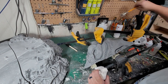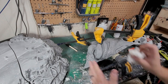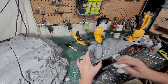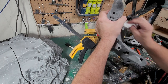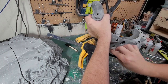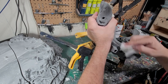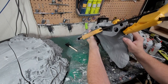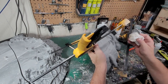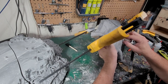That's going to kick off in about — it's kicking off in the cup. The five minute epoxy, you've got about — it says five minutes working time, but it's more like two or three. It all depends on how much you have mixed up too. The more you have mixed up, the quicker it's going to kick off because it's an exothermic reaction. As it heats up, it kicks off faster. I'm just going to go here and try to get as much of the ooze out as I can — hopefully that'll help fill some of the gaps.